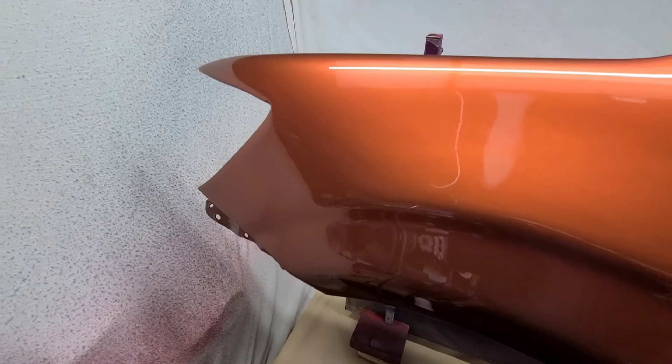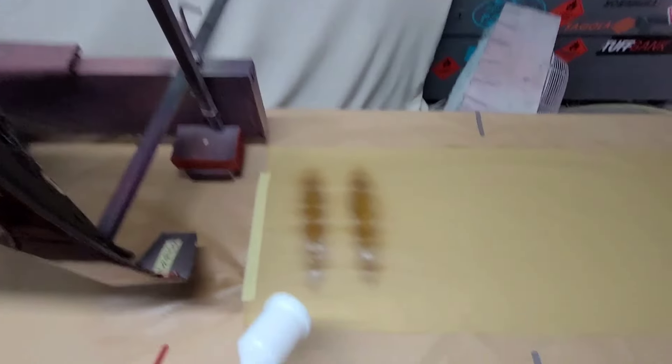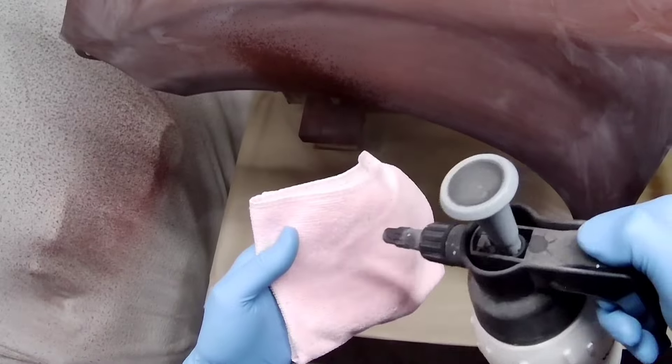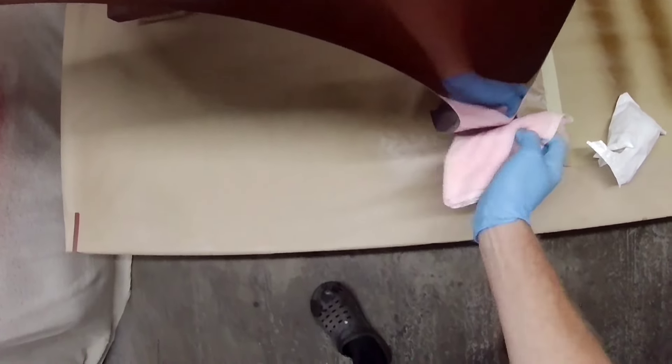You can see the 1.2 — I've always championed this little gun, it works supremely well. I'll put a link in the description to Spray Guns Direct where you can get these guns, and also to the various tip sets available to convert this gun. If you're going to buy a Compact, it is the same gun as the R150 just with a different setup and a bigger cup. If you buy it with a 1.3 and want to change to a 1.0, you just buy the tip set — basically a needle, a tip, and a cap. Looking at the difference between the two, you'll see the spray out in a second.